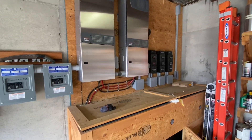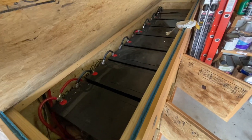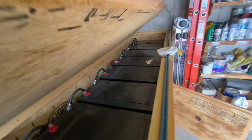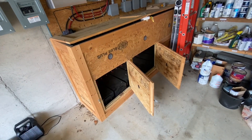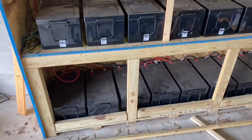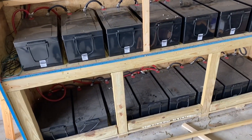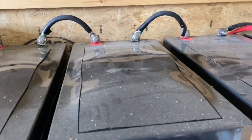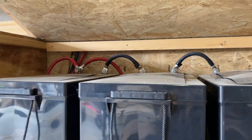The guy was definitely an electrician but he wasn't a solar electrician. These batteries are looking a little puffy. We're going to be changing out the sealed lead acid battery bank — this is a UPG battery. We've got to get this big old cabinet out of here first. There's nothing really wrong with a battery cabinet, this is kind of how you used to have to do it, but there is something wrong with using a battery designed for standby applications in a heavy cyclic application.